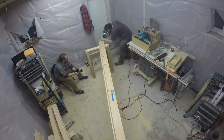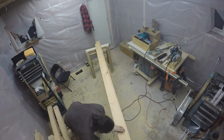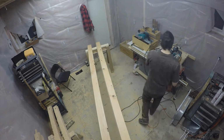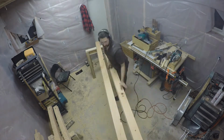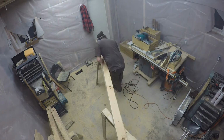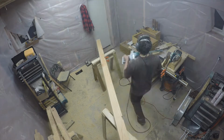And once the rafter lines were laid out, I cut 2 notches that fit on top of the posts, marked and drilled holes that the ridge beam is going to get attached, and then did a little final planing. And sanded these because I guess I was just not in the mood to plane them by hand.